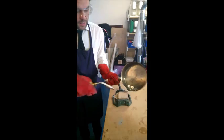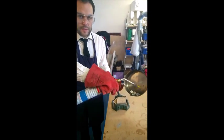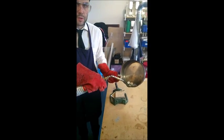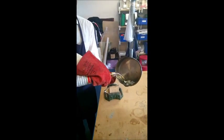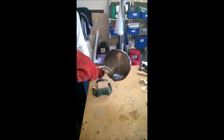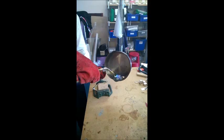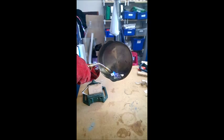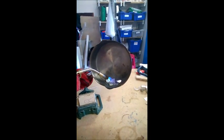We've got a pan here with a pouring nozzle that we're going to use. When heating, conduction allows the heat to travel across from solids, so just hold the pan at about 45 degrees toward the end of the flame — that's the hottest part — and hold it in place. This will melt the pewter quite quickly.